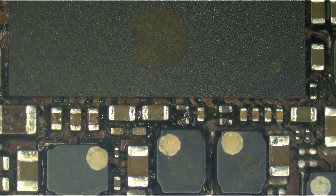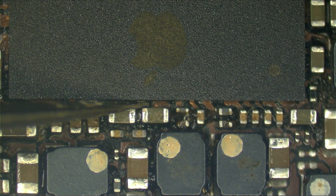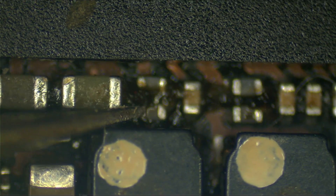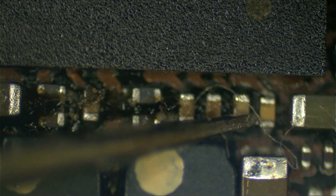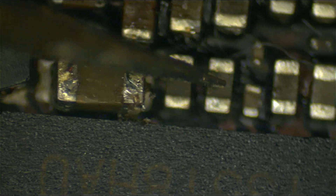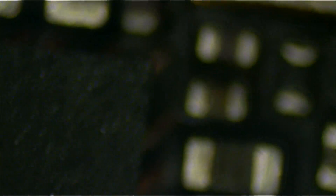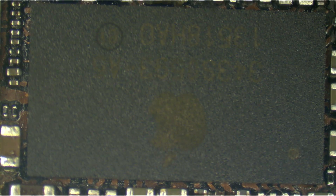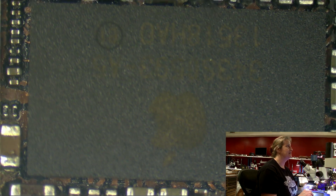We are completely missing the underfill. It has been very, very neatly — precision — cut away. You can even see all the way down to the traces underlying the board. There's plenty of underfill left stuck between the other components, and underfill remains around the other chips. But around the PMIC it is cleared away very precisely. You can even see cut marks and a little bit of exposed copper on that trace. So we can gather that this iPad Mini had a professional change of the power management IC chip, where the original chip had the underfill cut away and a new chip was placed — a very reasonable repair, and something I would do.